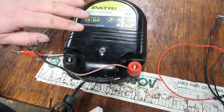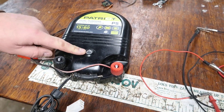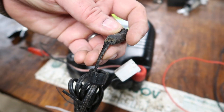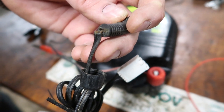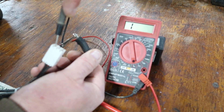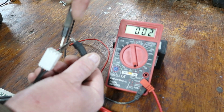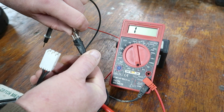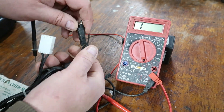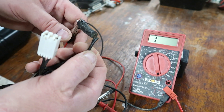Here's a real example from just last night. We plugged in the energizer for the electric fence for the ducks and it didn't work — the light wasn't coming on. On inspection, you can see the wires are broken. I connected one side to one lead and touched the probe to the other end — it goes to zero, so that side is continuous. On the other side, no matter what I touch, it doesn't change. That wire is broken.